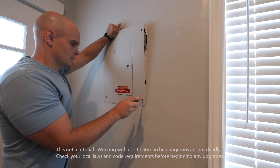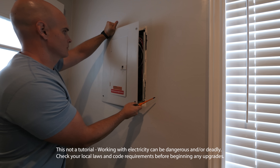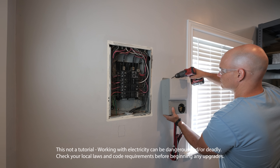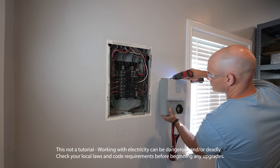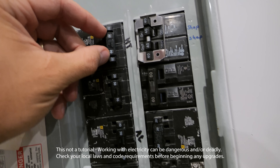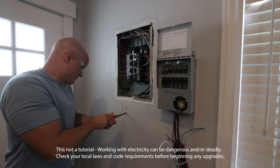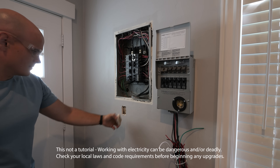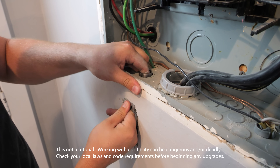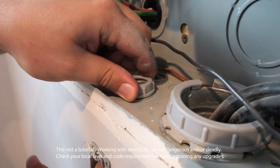Normally these would be placed inside a garage or somewhere more out of the way, but whoever built this building put the breaker panel in the kitchen. This particular transfer switch has 6 breakers, an inlet plug, and a row of manual transfer switches. It is pre-wired, and we take those wires into the control panel of the building and pick 6 of the circuit breakers to move over to the backup panel. With the breaker panel powered off, I can pull the original wire from the breaker and switch it with the new wire from the transfer switch. Then I splice the other transfer switch wire into the wire we just removed, basically putting the transfer switch in line with the load, and allowing the transfer switch to manually decide whether I stay grid-tied or completely off-grid, running solely on battery backup.